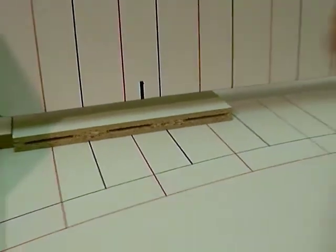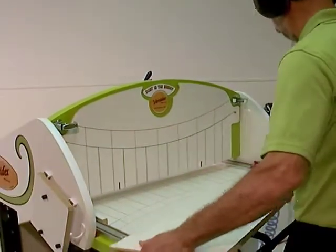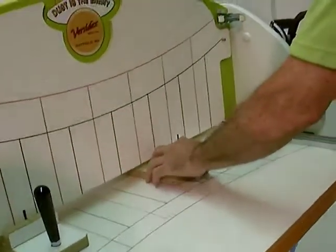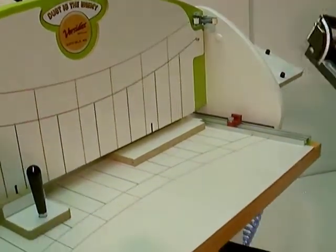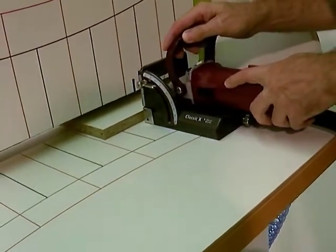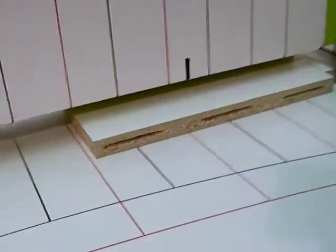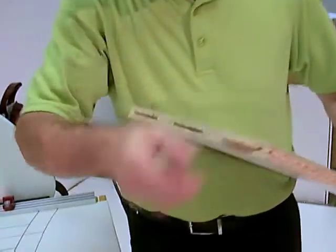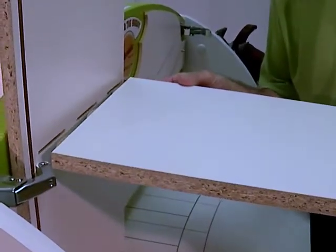Because this cabinet has but one shelf, we don't double mill, but we do have to balance the drop of the pressure bar on the clamping system. We do that with a clamp spacer equal in height to the piece being milled — in this case, three-quarters of an inch. With the shelf ends now milled, we can assemble the shelf to the side, and you can see how it fits and aligns perfectly, flush at the front and stopping at the face of the cabinet back.